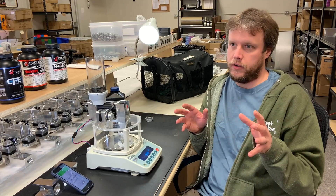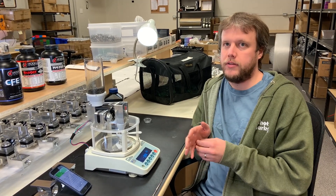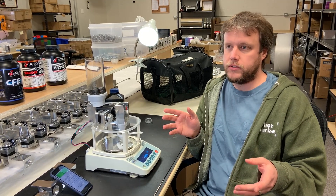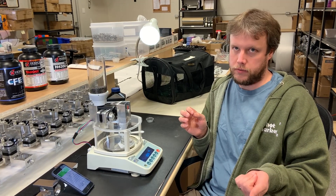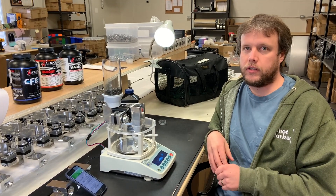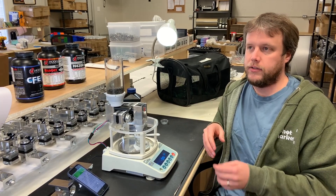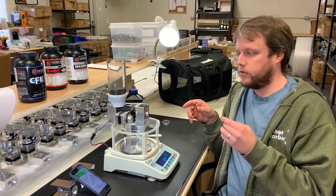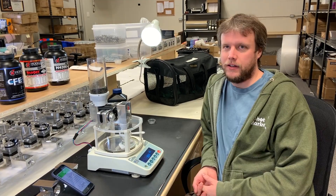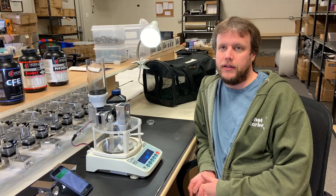Within the region of fine ball powders up to normal extruded rifle powders with kernel sizes up to around 0.03 grains, one tilt angle — once you find it — should work well for all of those powders, and differences in flow rate will be controlled by calibration. The manual says you want the flow to be between 0.1 and 0.2, which is a general guideline for most powders. But with N570 we've identified that we actually need more than that — it's not about the number, it's about how the flow is coming down the tube. If the flow is very sporadic and slow with large gaps where nothing is happening, it's too slow. I hope this video was helpful and informative — feel free to email me with any questions or feedback, and thanks for watching.